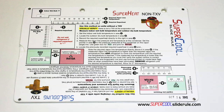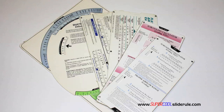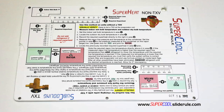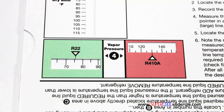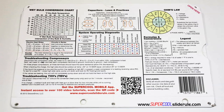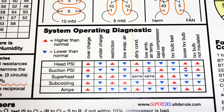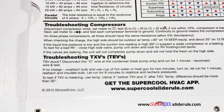I'd like to take a minute to introduce you to the coolest tool in the HVAC industry. Historically, technicians have carried four or five different slide rules — one for R-22, one for R-410A, one for metal duct sizing, one for flexible duct sizing, and others for diagnostics or troubleshooting. Thankfully, those days are gone. This one tool will allow you to charge a system with R-22 or R-410A in either the superheat or sub-cooling method. The back cover contains required formulas, capacitor rules and practices, a wet bulb conversion chart, how to perform computations on series or parallel circuits, an electric heat strip guide, a complete system troubleshooting diagnostic chart, and how to troubleshoot compressors and TXV.